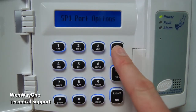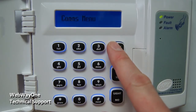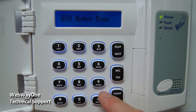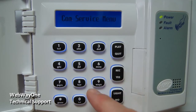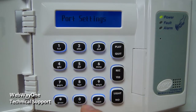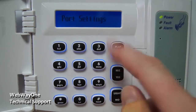Once you're finished in SP1 port options, exit back to the comms menu and navigate to the comms-service menu. In here, navigate to the port settings and once there, check the baud rate is set to 2400, parity is set to none, data bits is set to eight, and stop bits set to one.